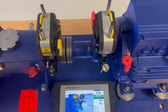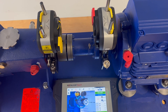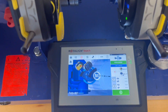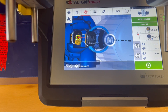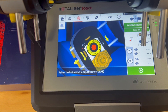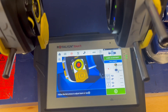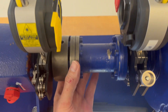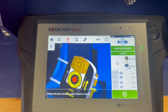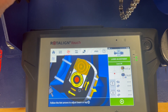In order to do the shaft alignment of the motor and pump that we have in front of us, we can first check whether we are all the way along with our sensors in the field. On the upper right side we see that the laser is okay — still on the far side, on my side — and when I move all the way along to the other side, we see that the laser basically stays in this inner square. So we are good with the setup of the measurement.